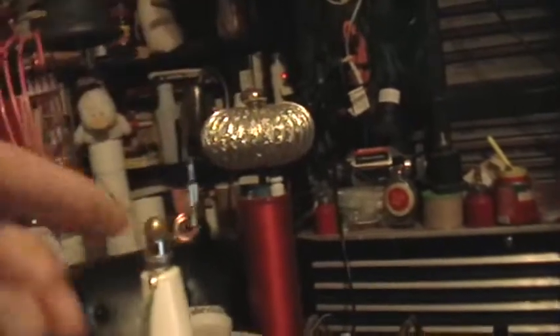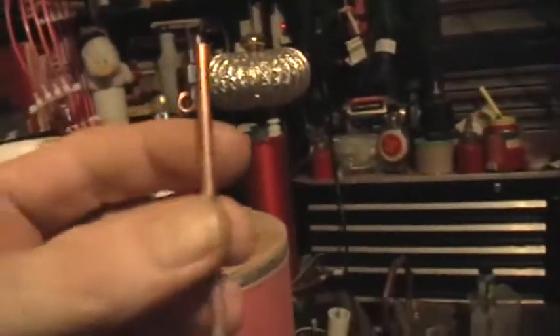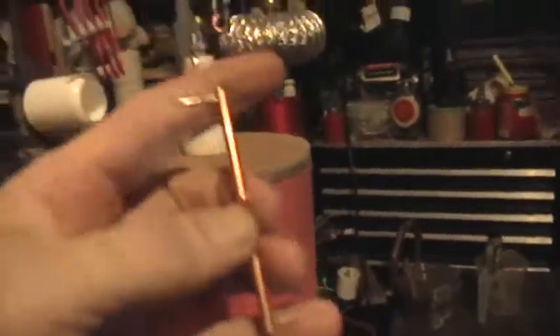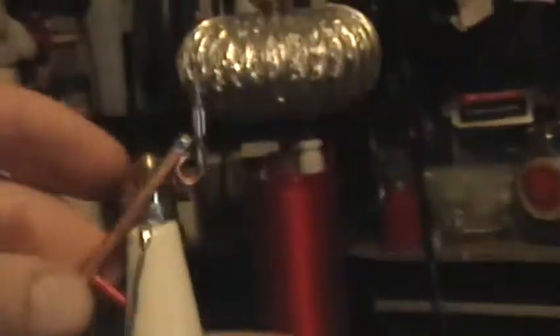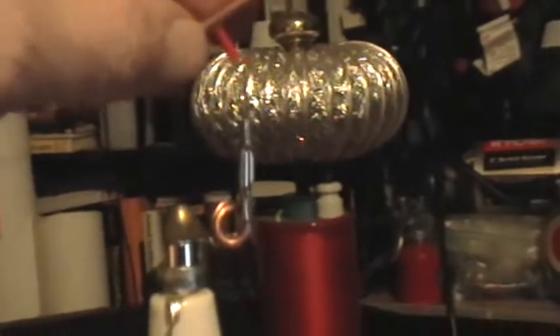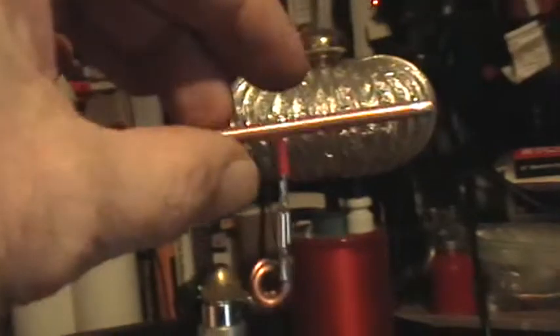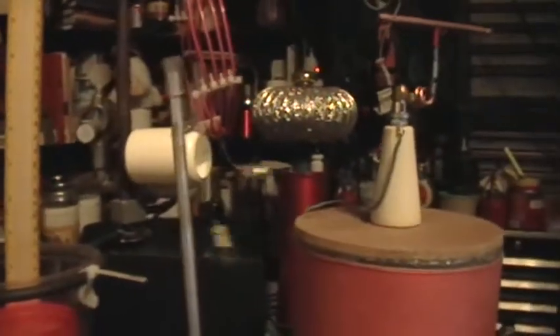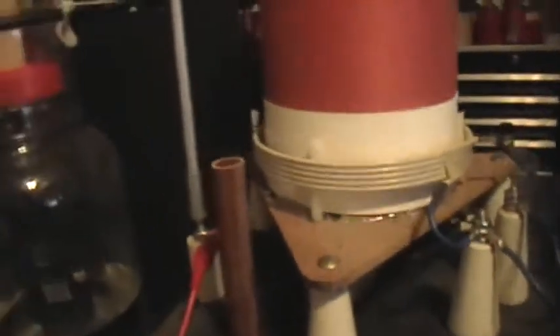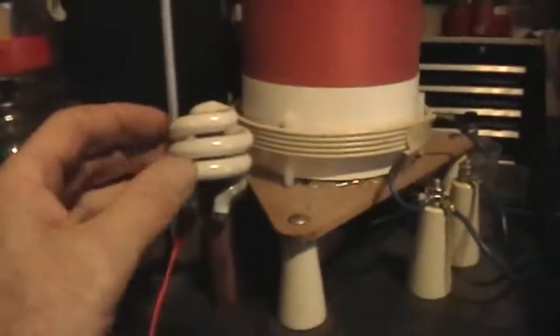This is a little corona motor. I mounted a sewing needle up in there to make a discharge point, and then made a corona motor out of a piece of copper tubing with a couple of needle points soldered in place, and a little plastic guide tube to keep it upright on the pivot point of the needle. The stud on the ground connection can support a light pole — here's a little aluminum holder with some neon bulbs dangling from it. And this other holder is usually where I put a gutted compact fluorescent for demonstration.